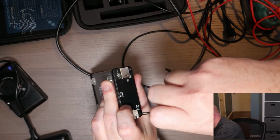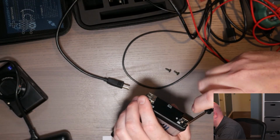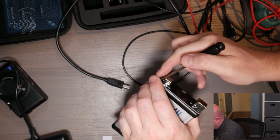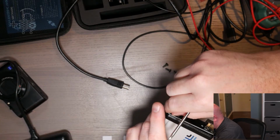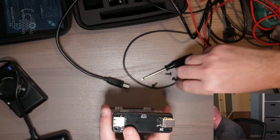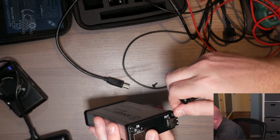There's a sense resistor on the front panel. I'll take a closer look. Man, this doesn't seem right. Oh, this isn't in right. That's why this is feeling funny. I did something wrong. On camera distraction. After I put this together, I'll show you one of these panels a little bit closer, so you can see. Maybe the panels themselves are the actual sense resistors, using a precision PCB manufacturing process. Yeah, I totally missed the slot on that. Good job. Okay, that looks better. So maybe just the resistance of the traces themselves is the built-in sense resistor. I guess it would make more sense to have the sense on the panel than go to the board and back.